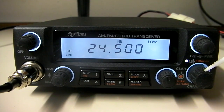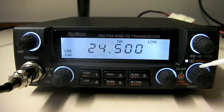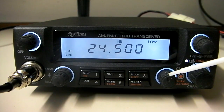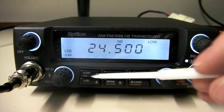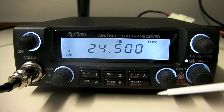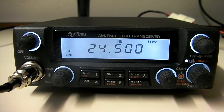We've got our channel changing control here to change frequencies. The clarifier is also your function button — if you push it in once, it enables the function option and helps enable some of the secondary features of these buttons. There's also a narrow IF filter, which is something we haven't seen on too many export radios. If you hold this in for about 3 to 4 seconds, it enables the filter. There's a light right here that turns orange when the narrow filter is on, which can clean up signals and make it easier to hear stations.